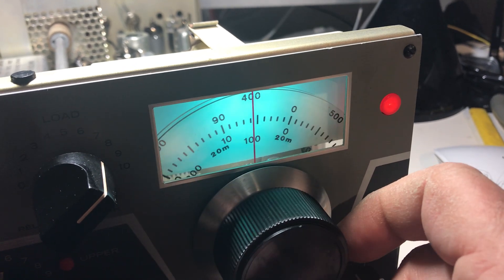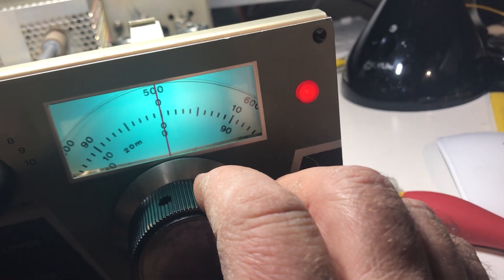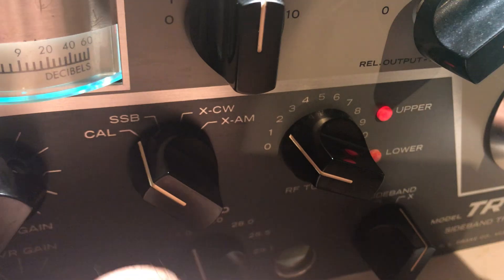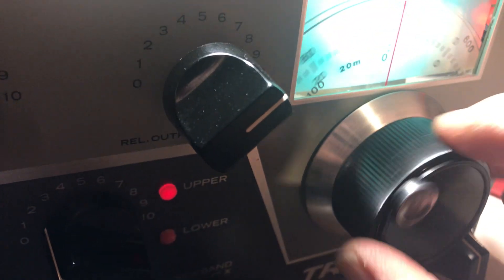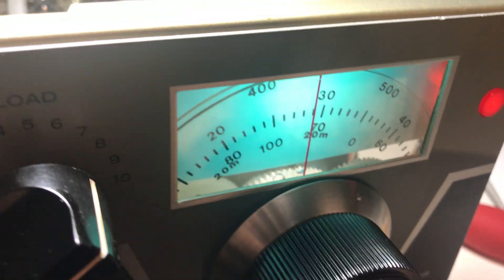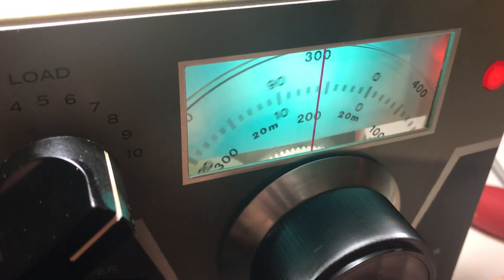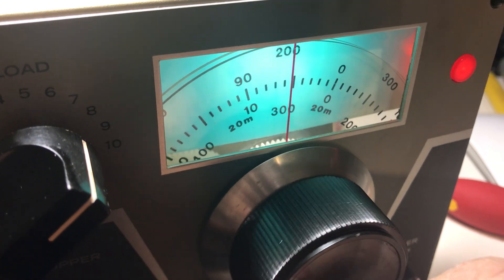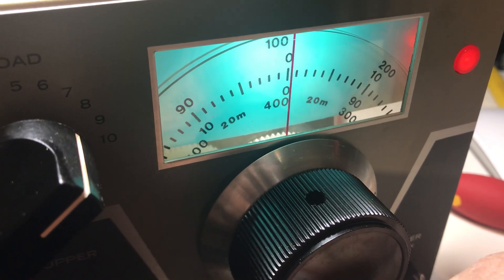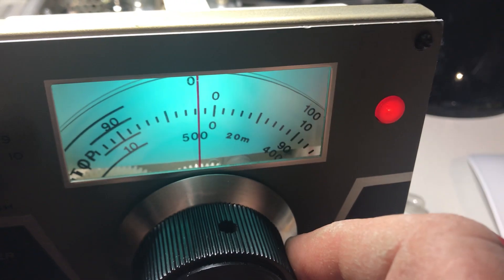Just kind of radioed out here. It's working good enough. What about the other bands? How about 20 meters? 20 meters from this thing is backwards so we're at the low part of the band now. That's 14.0 right there, 14.1, 14.2, 14.3. I could skip this thing over one tooth to get it to line up a little better, but it's not so bad. If you look at it straight on it's pretty good. Let's go to 15 meters.